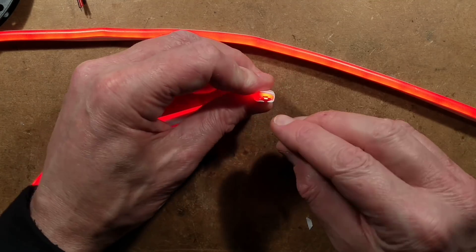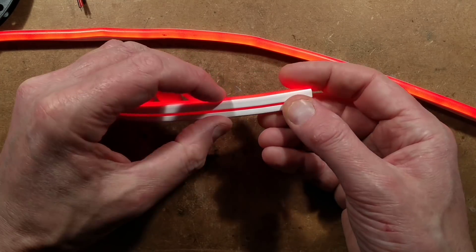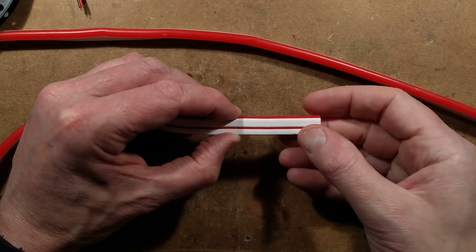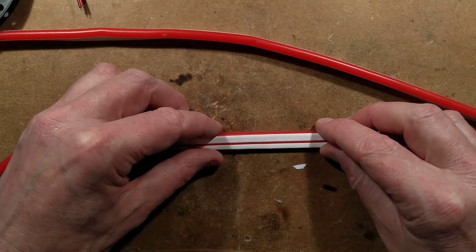Because the LED tape is mounted sideways, they've got vivid black stripes at every cutting position, and you can actually see them through the tape even when it's off. You can see those distinctive black marks - there, there, there - and that's where you can cut.